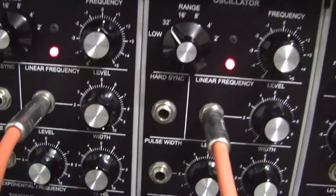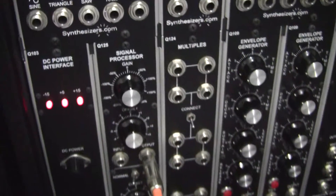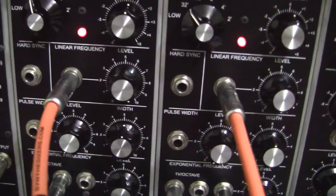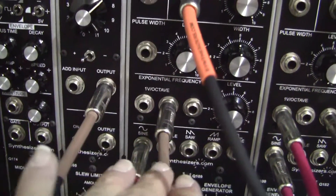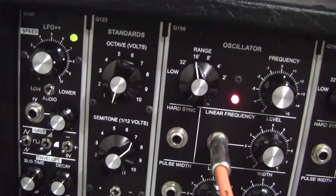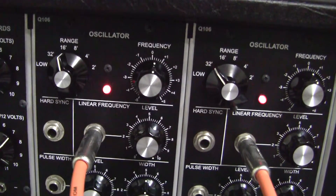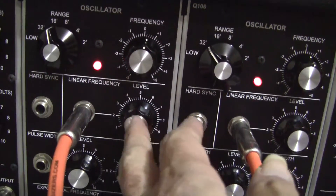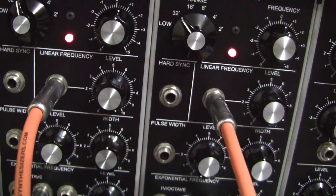On the modulating oscillator I also have this orange cable which goes to the upper half of my signal processor, allowing me to send a fixed control voltage — right now it's not doing much, it's just to get the frequency right. The coarse frequency is being set by this one volt per octave brown cable going into my standards module, which gives a very accurate pre-controlled voltage that will force this oscillator to give around 100Hz. I can make my fine level adjustment using this control here.